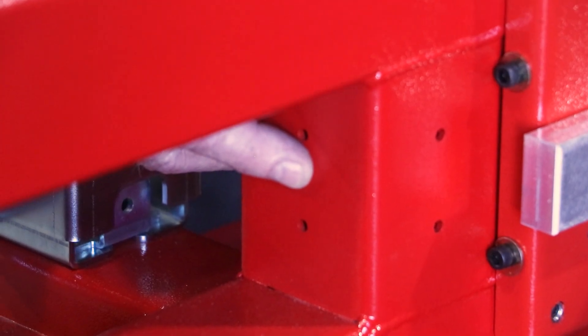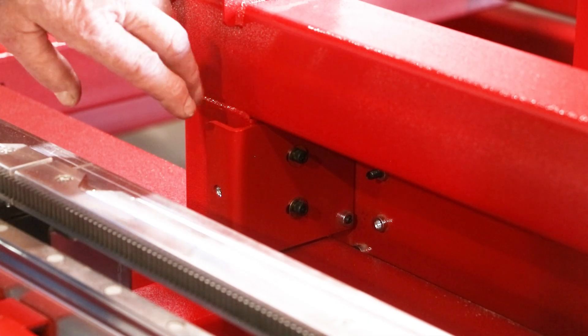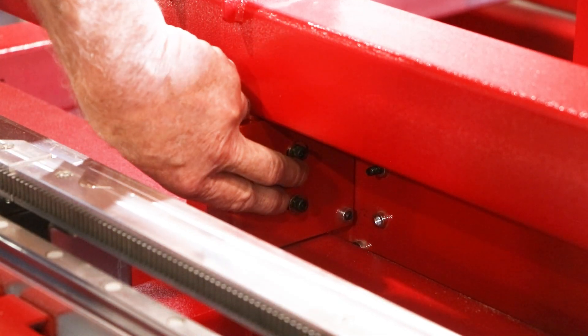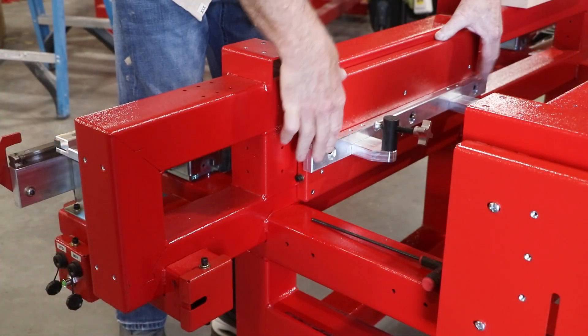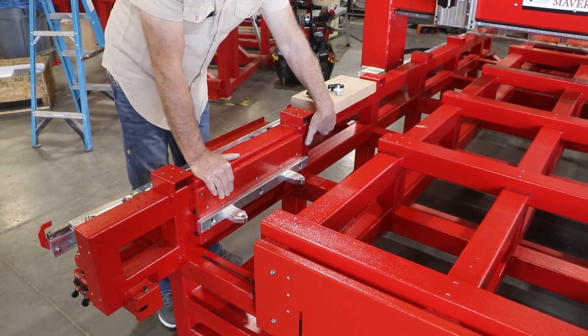Each frame on the G4 series has holes in these vertical tubes, and they're on both sides of each tube. Those holes will be tapped — you'll have to tap those. Once I've tapped the holes, I install these brackets with a couple of quarter-twenty one-inch screws with some flat washers. This holds the assembly to the frame, and this plate then goes on those two brackets.